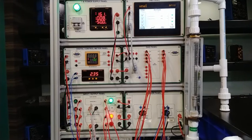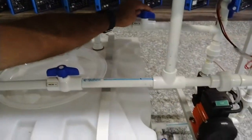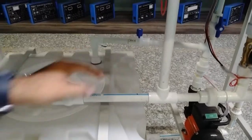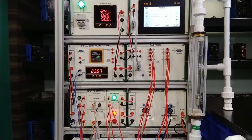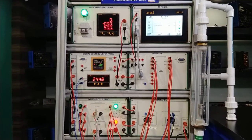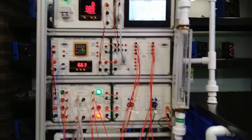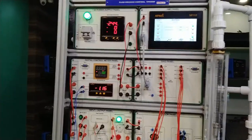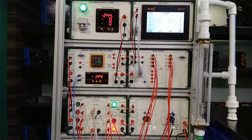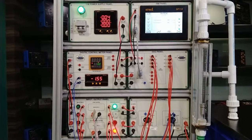This is the minimum value of the flow. Now we will fully close valve V2A again to increase the flow back to maximum, which will direct maximum flow to the electromagnetic flow sensor. This is how we do the flow process control system. We press the Valve button so the measurement tank drains to the sump tank through the solenoid valve and V5 bypass valve. This is how we complete the experiment of the flow process control system.